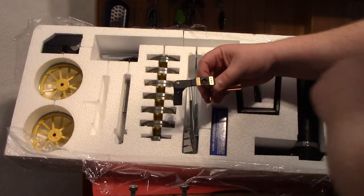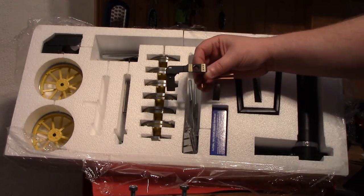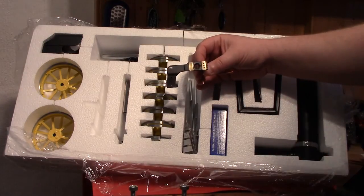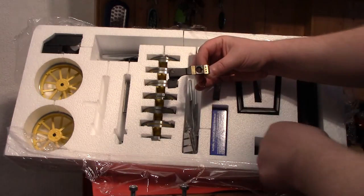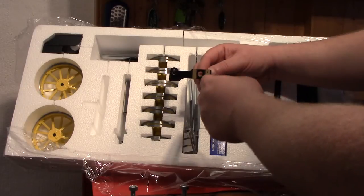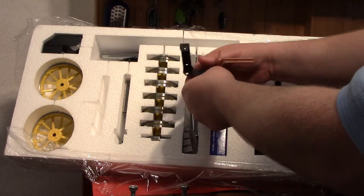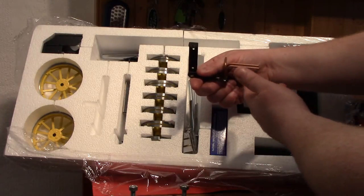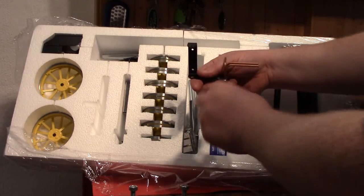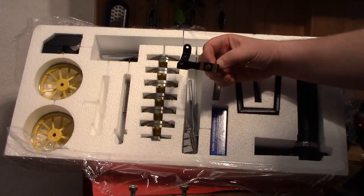And Dave showed me how he soldered these. Very easy when they do it like he did it. He's got what he calls a heating fork, and he puts it on a boiler that's essentially a jig. Secures the frame in. Obviously he puts it on the bench and he puts the heating fork in there. Now the prongs on this fork go through the three holes there. Then he places the pre-bent tubes, cut to size, in the right positions on the fork, butting up to the side of the engine frame by the ports.